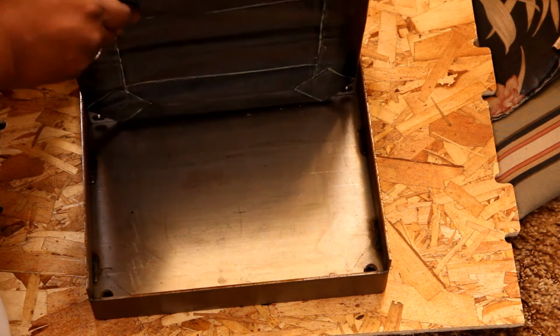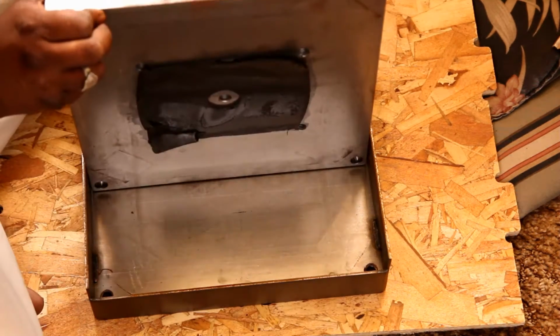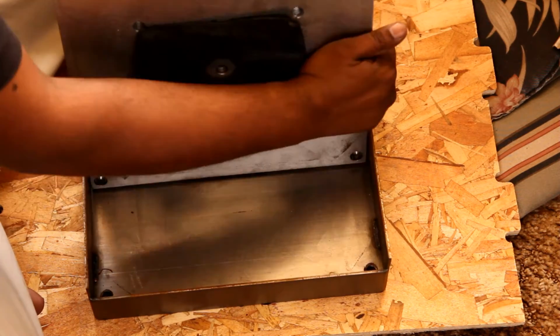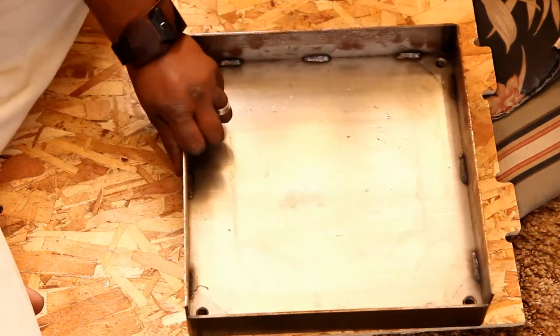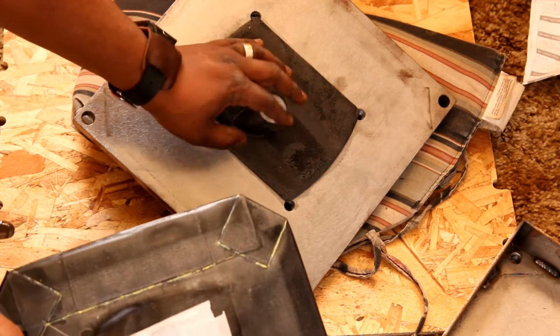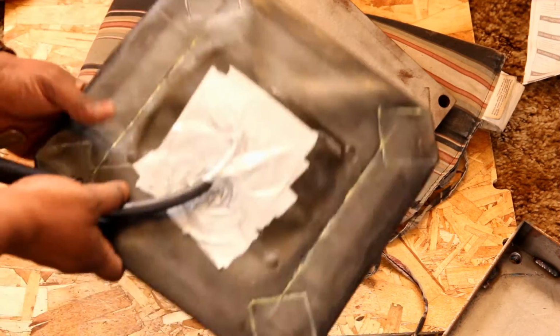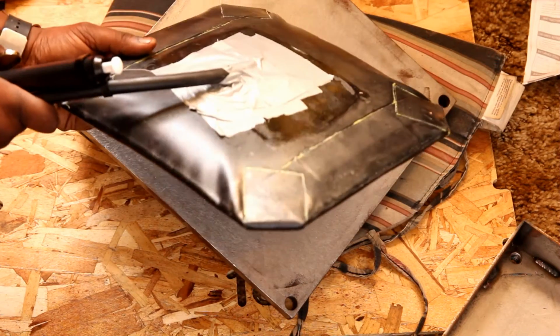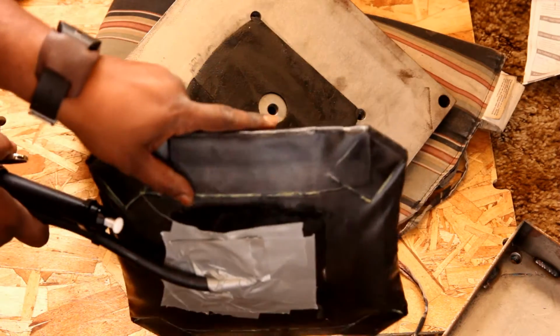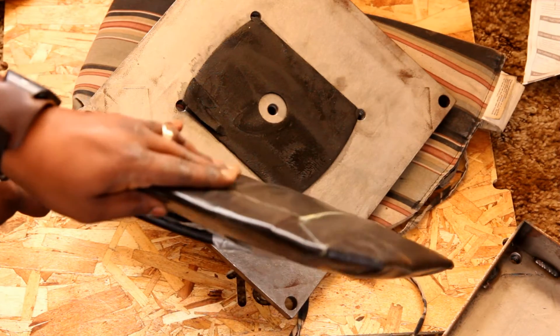I actually ended up peeling this off, and it peeled off really easily. I think part of the leak was in fact from the adhesive pad not adhering to the air bladder. One quick tip, if you want to check the air bladder, what I ended up doing was duct taping and sticking an air hose in there and testing it out, because you do want to check to see if it is the air bladder that is actually leaking or if it's just the adhesive section that has come loose and not allowing the air to stay put in the bladder.